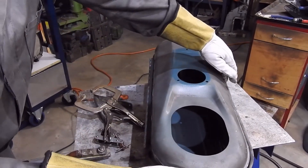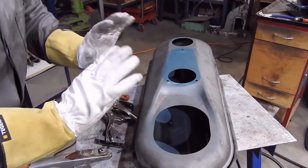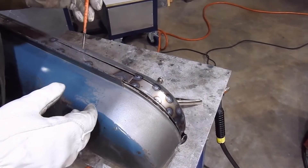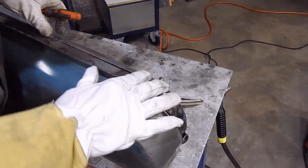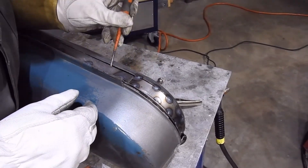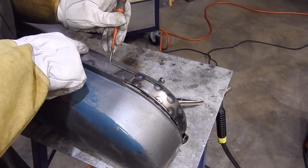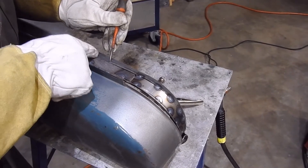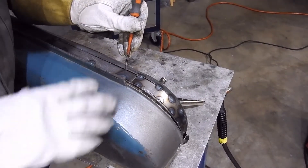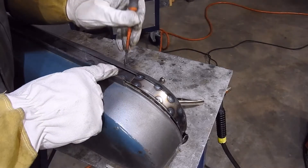I need to get this flange lining up with this one, which means that this strip here probably has to tilt that way. This can be a bit like trying to wrestle with an octopus because you need 14 hands to keep things happening. I've got that pretty much matched up but I've still got this seam here low - I've tried beating it from the underside and it's coming a little bit but not all the way, so what I'm going to do is use a screwdriver as a lever and work my way along, tacking in there and then moving along and tacking in there to actually get a flush surface. Once this is done I can put it on the drill press, try it out, check that it fits, and then fill in some weld.